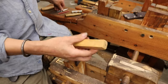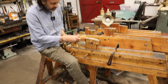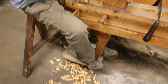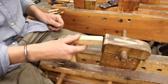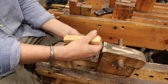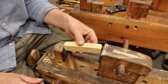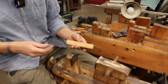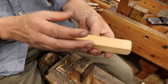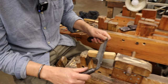To begin the process, I'll put this in the shave horse — one that Lee Stoffer made for me a long time back, tweaked a bit, but the basic design is as is. It grips between centers, because if you have grips like this you just haven't got the shape. I know you can use a spoon mule type design, but this works well for me. I've roughly marked centers and where the breaks are, so I'll start shaping with a draw knife.